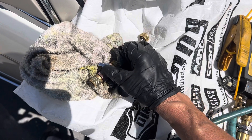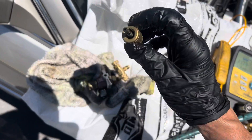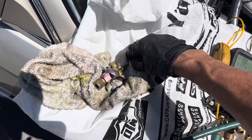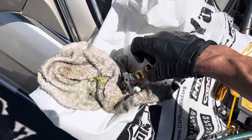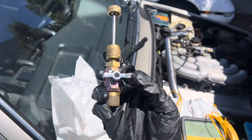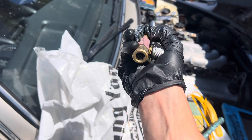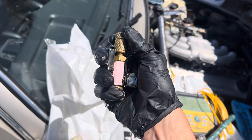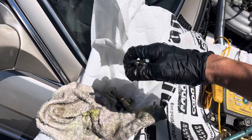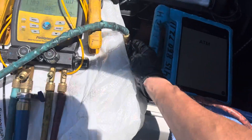You twist it and you'll remove the valve core. It has a rubber O-ring and a seal inside — it doesn't lose any gas. Pull this all the way up after undoing your valve core, turn the valve knob right there, and you've sealed off the refrigerant while the valve core is removed through here. Throw away the old valve core, put in the new one, reinsert the tool — it will not lose gas. Open it up, screw in the new valve core, back it off, unscrew the fitting, and you lose no gas.